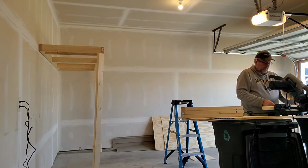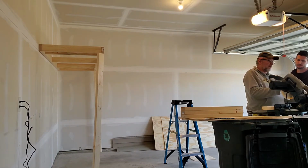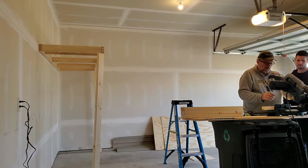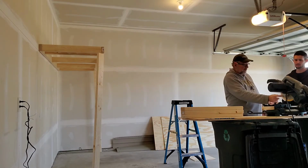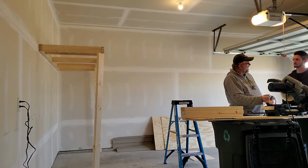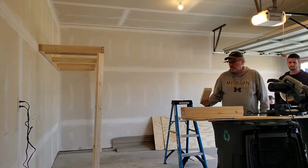Look, when you're cutting, can you see a little bit of black right there? Yeah. So that's saving the line. Now, if I had made a mark and went right in the middle of it, then you cut everything right in the middle of it. But you're taking an eighth of an inch, a 16th of an inch of the saw blade. The saw blade's an eighth of an inch wide. So if you take a 16th away, you're screwing your dimension. Okay. So you always go to the hand saw?